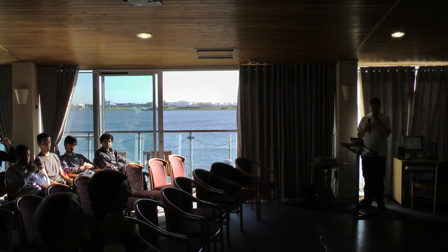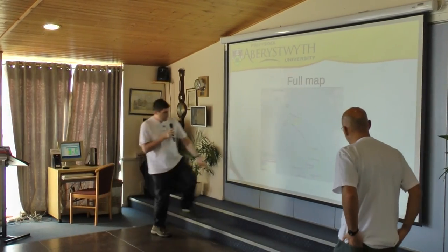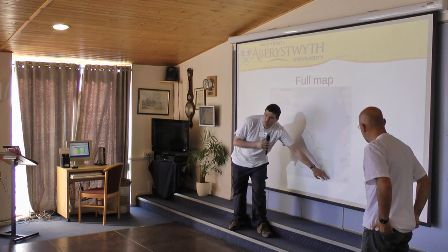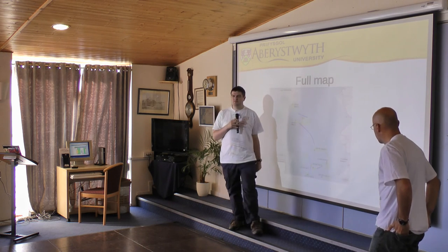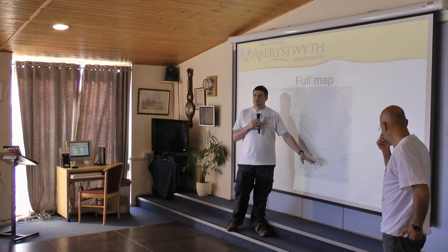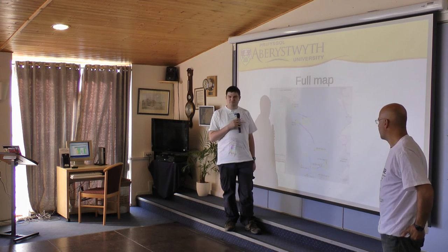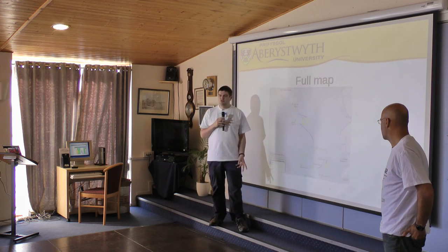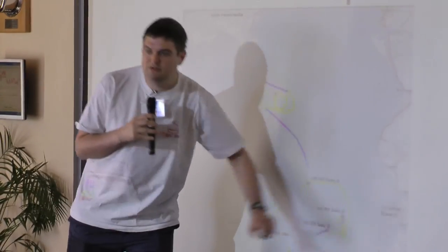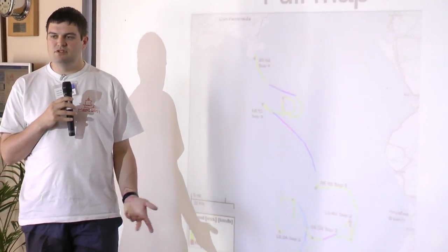Colin, what was the target course you planned for? So, to go back to that page, the original target was to launch here and wash up here. So the first hour or so, a couple of hours is good, and then it just completely deviates. Because that seems quite random. Yes. But this is only compass heading control. There's no GPS. Yes, but can you call this true navigation? Or just let the boat go with the wind and with the tide? I think it's somewhere halfway between the two. It's certainly not controlled navigation, or else it would have been a straight line over here. But it's an attempt at doing it with just the rudder. And I think that's not enough. You need a sail actuator.